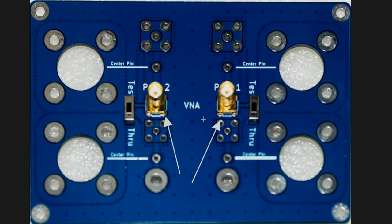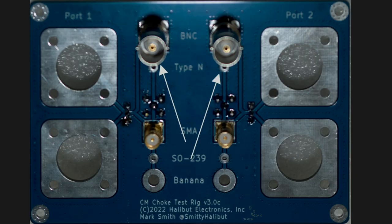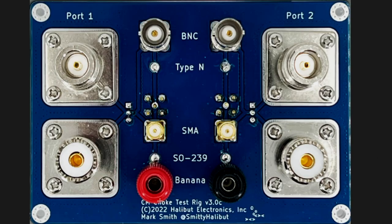Next came on the same side the two SMA connectors. This is the back side of the board, so we're going to call this the rear. On the front side, I installed the two SMA connectors — went fairly easily, they're not hard to put in. Then the two BNC connectors, again fairly simple soldering. Then I mounted the two banana jacks, the SO-239s and the N female. On the opposite side, there's a wire from the center pin to a spot on the board, so it's a pretty easy thing.